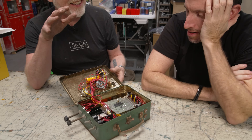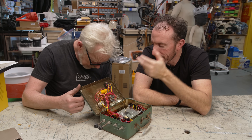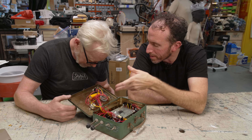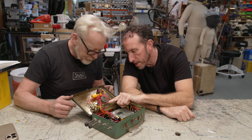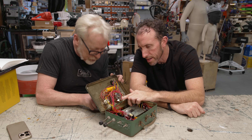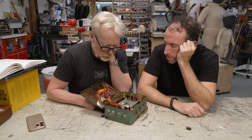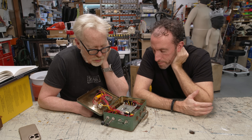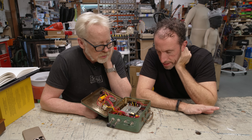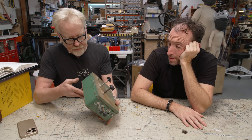These are adjustable parameters. Every time we think that the 1960s are primitive, I come back to things like this — these beautiful, simple little designs. You could clean this switch. There are no switches that you buy now that are cleanable like this. You can spray contact cleaner in there and hope for the best, but these you could actually service. This is a selector — probably selecting which resistors to use for either the PWM frequency or other parameters. There's nothing that says 'radio' in this — no crystals, no inductors. I think this is just a motor controller, but a really, really cool motor controller.